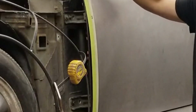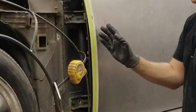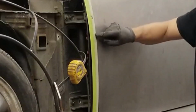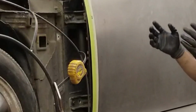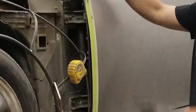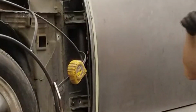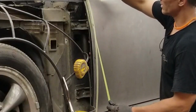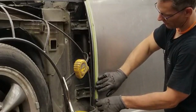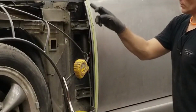So when we peel off these two green lines, we have to add 1/2 inch extra to the front of the beige line. Otherwise, if we cut at the front edge of the line, we'll have no flange to bend over the door structure. So that's what I'm gonna do now, is take off these two green tape lines. You can see the markers already there. I added half an inch to that beige tape, just like that, it's good. And we marked that line.